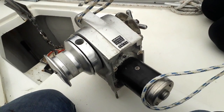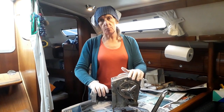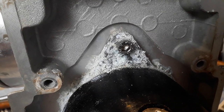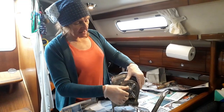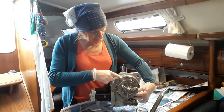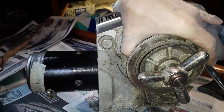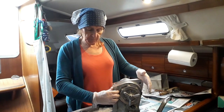What we did was we put the halyard onto it so that we could pull it up while I basically manoeuvred the cables through. Tricky but not undoable, but the amount of salt is just ridiculous. Right, we've got the entire unit here. There are a number of components. This is the motor which appears to be held in with three bolts. This is the gypsy which pulls the chain. It has this interesting feature — the gypsy has little notches on it and this little pin can be pushed in when the anchor is over to stop the gypsy turning, like a chain lock.